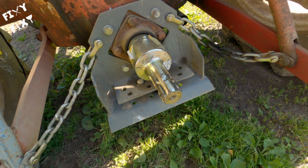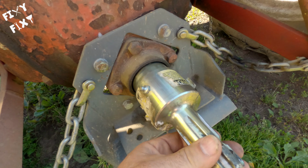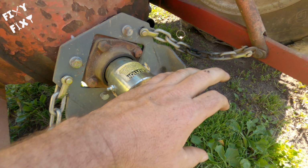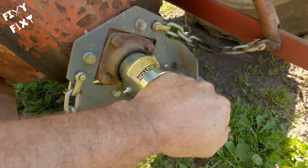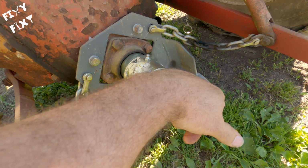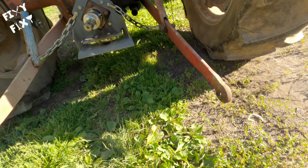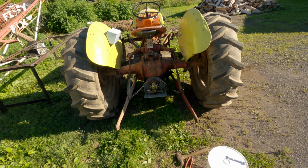So now when that brush deck is spinning and you push the clutch in, you can stop the drive axle and the brush deck can continue to spin without trying to force your drive axles forward or backwards, depending on the direction you were going when you push the clutch down. That's it. Makes it a much safer machine to run.